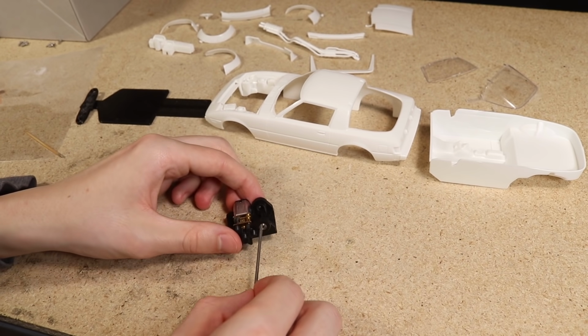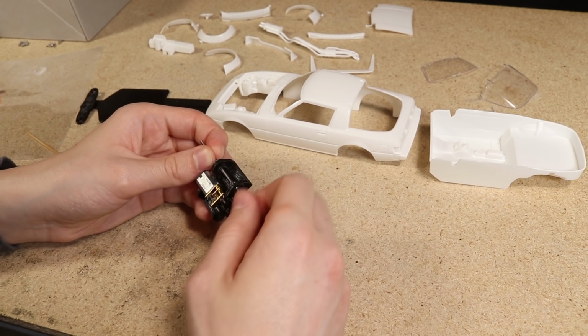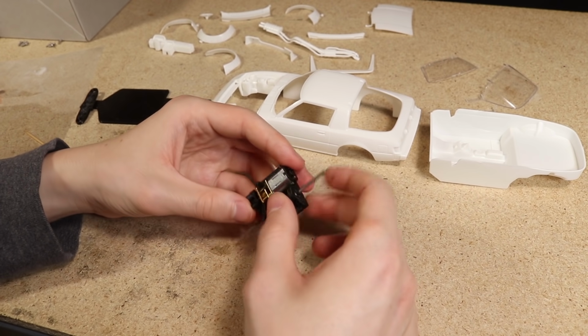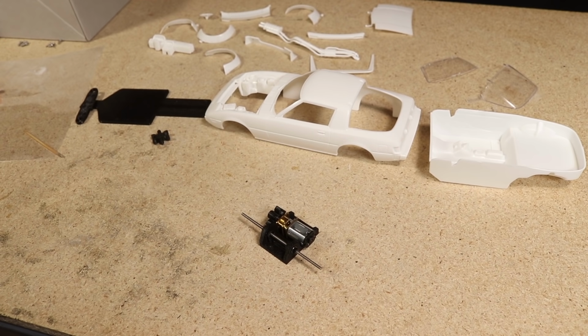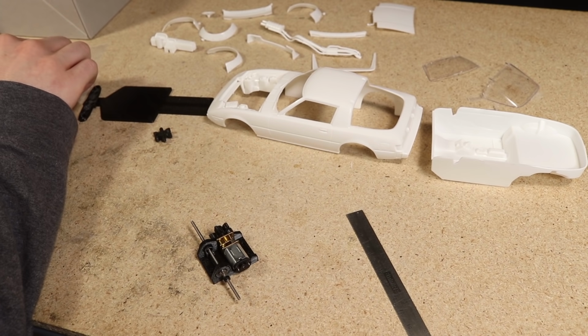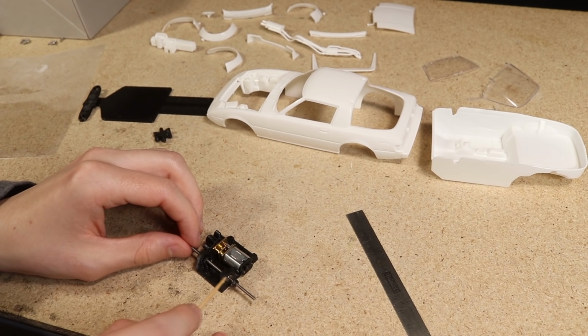The threaded axle shaft goes through the bearings, and I use 2 hex wheel mounts on each side to secure the axle, making any adjustments so there is the same length sticking out on each side. Once that looks good, I glue the wheel mount on the opposite side of the gears to the shaft. I do not glue the other wheel mount.